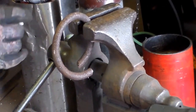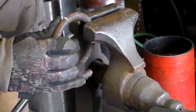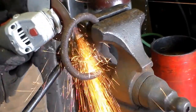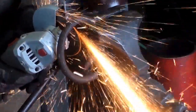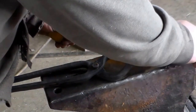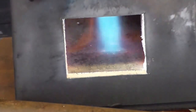I've got a face shield on and hearing protection on. I'm marking this where I want to cut it and got it locked in a vise securely — now I'm just going to zip through it. There's the material we're using. Put a flexible tape on here — should be about eight inches in length once we straighten her out. I just lit the forge so it's not super hot yet, but it will be, so we're going to go ahead and stick our stock in.